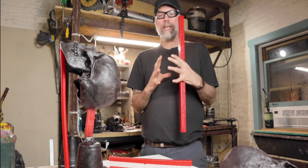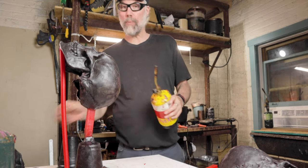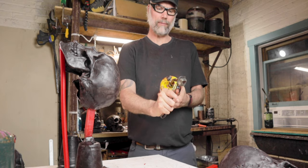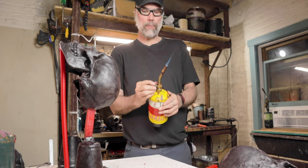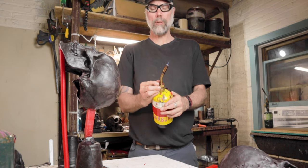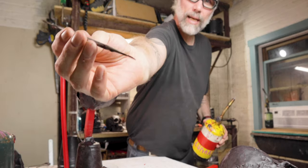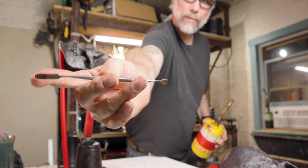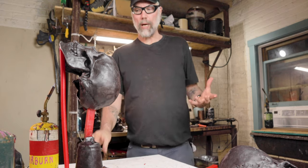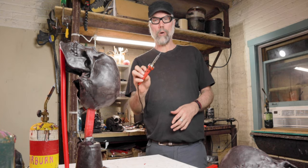That ultimately leaves us a clear path for our pattern wax to evacuate evenly and quickly. Because as everything heats up and goes to a molten state it is expanding, and we don't want to crack our shells. I'm going to use a propane torch and a metal tool — whether that be a dental tool or a small sculpting tool. I'll also use an electric soldering iron when welding gate to gate or gate to cup.